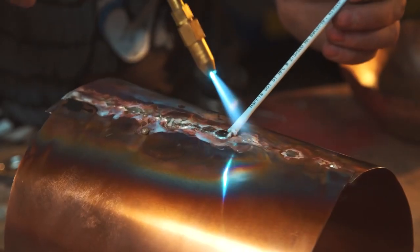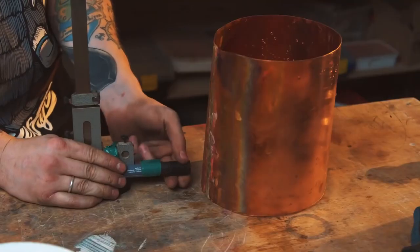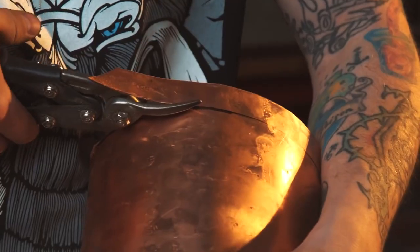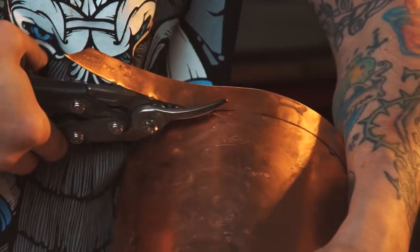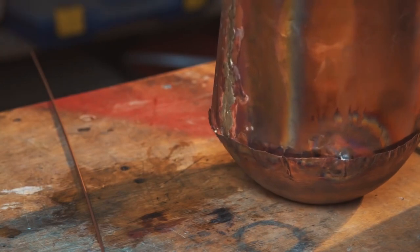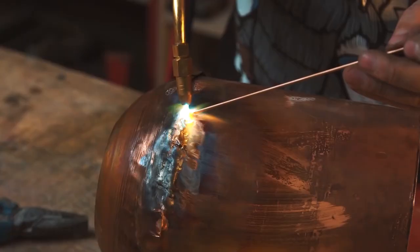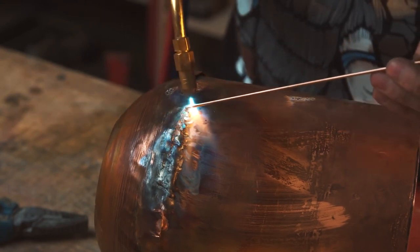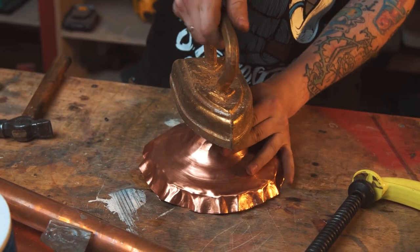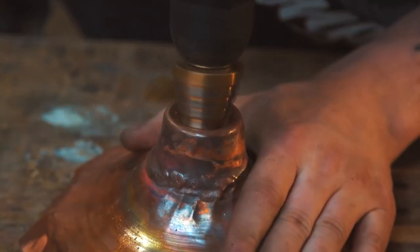Then we'll check how leak-proof it is. After the nominal cone is on the table, I propose to fix the teapot. Let's cut off the excess material — if these scraps won't be used anywhere, we'll melt them in the furnace. I have decided to cut the bottom into petals and bend them. It takes a bit longer to solder, but these two parts will better link up. After several soldering points have been done, we can warm up some of the copper and hammer it down to the upper part to reduce the gap — you'll save some solder, it doesn't grow on trees. So we have something like a helmet. The hole in the bottom is sealed up. From two shitty details you can make one proper if you have a golden press iron. The pipe goes up from the kettle — drill through the lid and weld on the pipe.